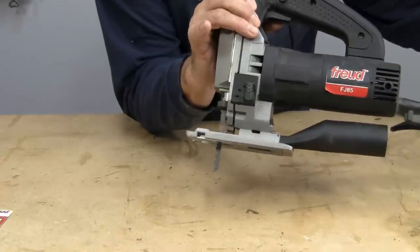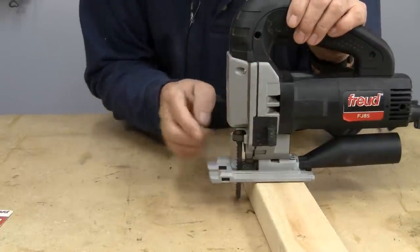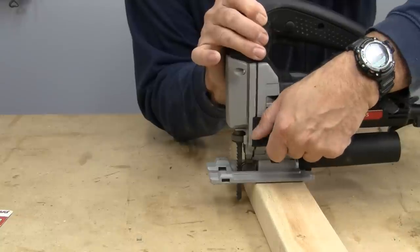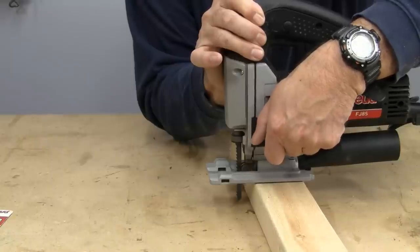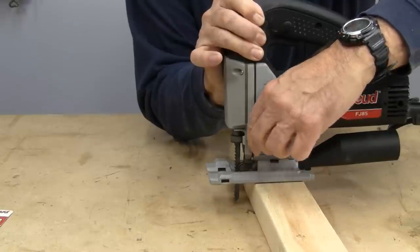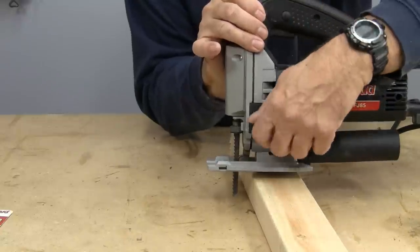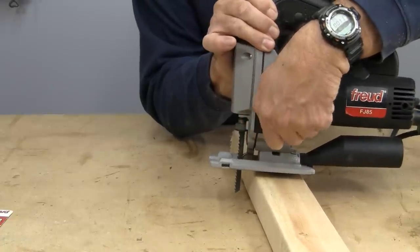Another feature of a lot of these is they have an angle adjustment for the blade, so you can move it back and forth. If there's a little lever close to the blade, as I move this down, that blade will move forward just ever so slightly — you can see it just a little bit. We're going to talk more about that lever. What it does is if you move that blade forward just a little bit, it basically speeds up the cutting.